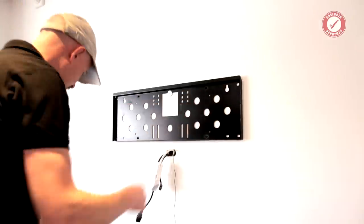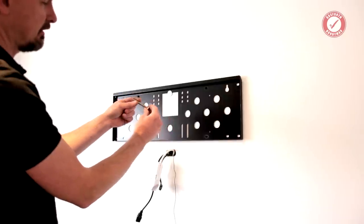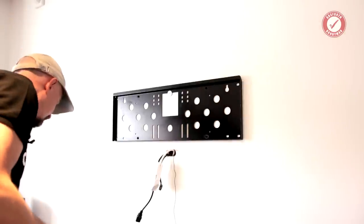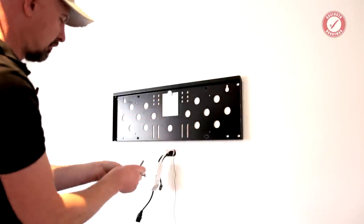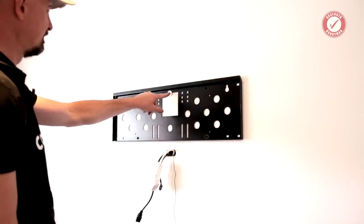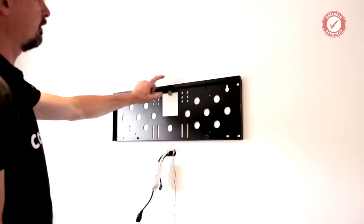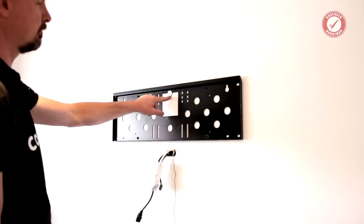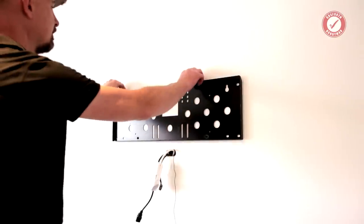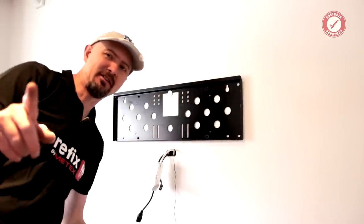All four wall bolts. Wall bolts, by the way, they have a metal fixing in the wall that expands and a giant bolt that goes into it. And this TV was held up with four of them because it weighs 30 kilos. We now have one single Metex CoreFix dot and dab fixing in the middle, and I can confirm we're definitely into a hollow section of plasterboard there as well. We're not into a dab. You can hear it's hollow. So we've literally just got that one screw and nothing else. If this doesn't hold, Metex, you owe me a TV.